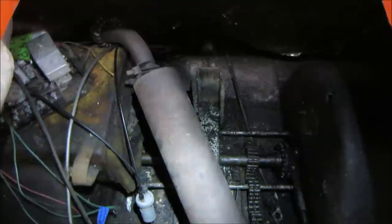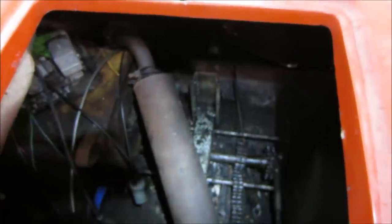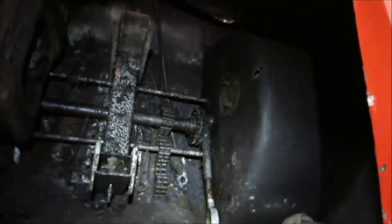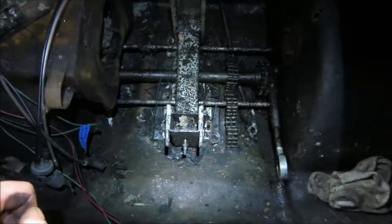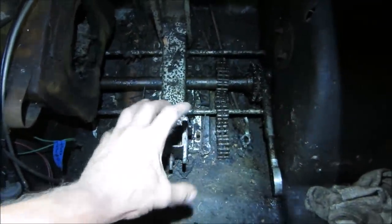What we should probably do is get the exhaust out of the back of the machine and walk over with the engine, kind of set it in there, and start looking at where things are going to line up. To get us where we need to go, I'm going to get that clamp off, split this muffler, get that exhaust system out of our way. I really don't want to start cutting on this bracket until I have to, but we may end up just slicing it flat to get room in there to work. That came apart way easier than I expected. I want to take this thing outside to the pressure washer and pressure wash the whole inside of it - especially when you start doing repairs and fiberglass work, you need a non-oily surface.